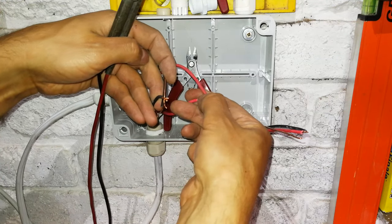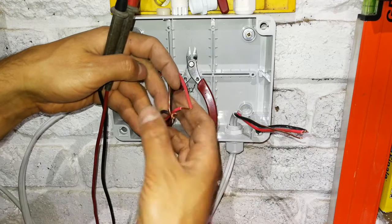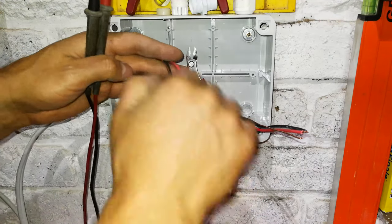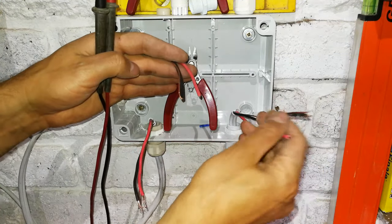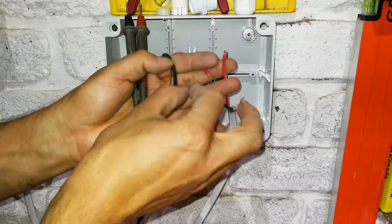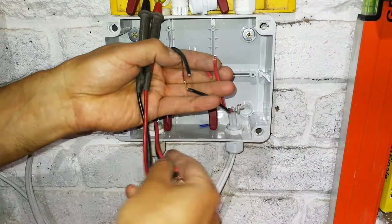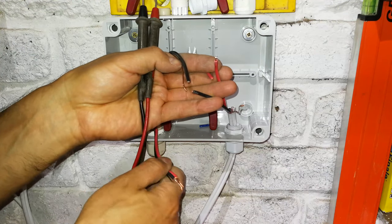Now the electricity goes off. Maybe there was load shedding. Maybe there was a fault on one of the power lines. Right, boom. Now you change over to your generator. So that means you're disconnecting that and you are now connecting that live and this neutral together. That means that you are completely isolated from the utility, your power company.